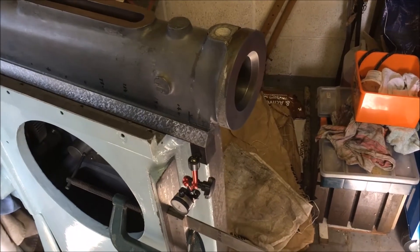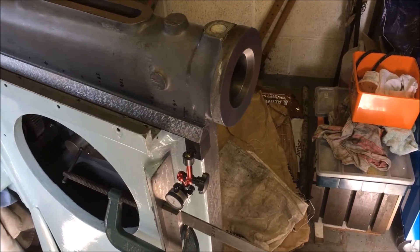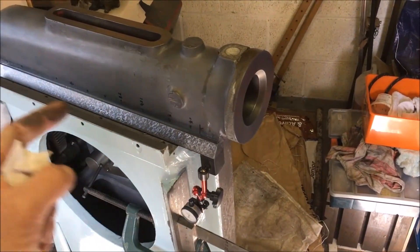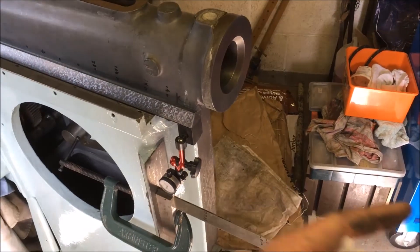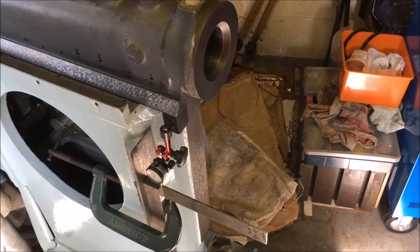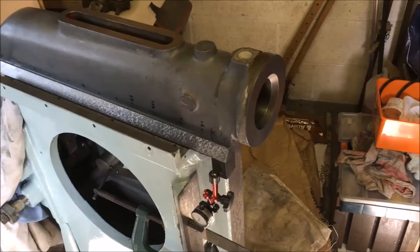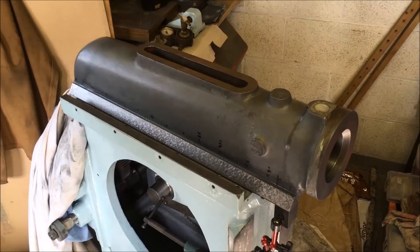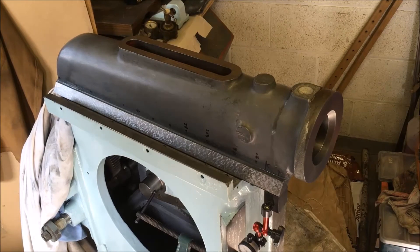The other option is that I put it all back together, finish scraping up the bearing surfaces, and then just take a light cut off the top of the box, which would obviously then bring it in parallel to that. I thought it'd be four thou at the far end and back to nothing there, so if it took a six thou cut, it's not a big job — probably half an hour — as opposed to trying to scrape all that lot back, which is a couple of months. So I'm going to put this up as a quick question on Practical Machinist and see if the general consensus is to take it off the top of the box, or what else is offered.